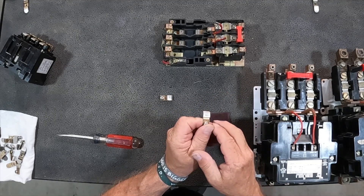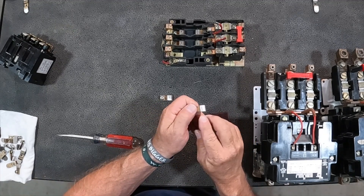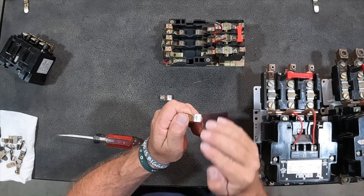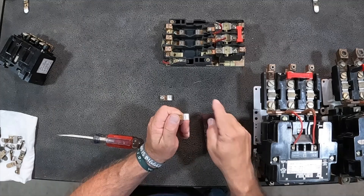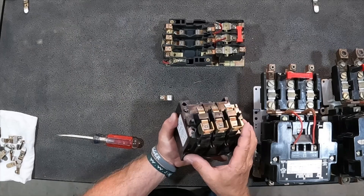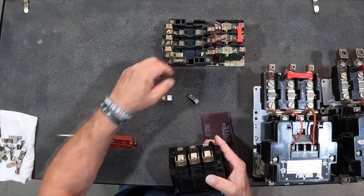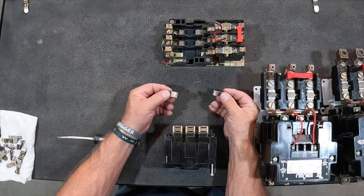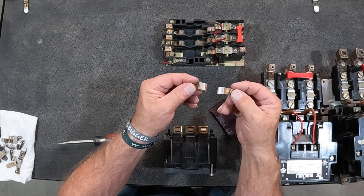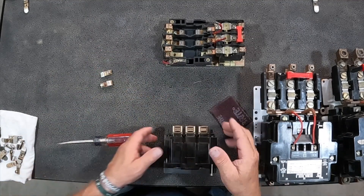You don't want to get too deep into it. If you start with something like a belt sander — which is a little aggressive — you make the silver pad surface uneven. If you make that uneven and you have three of these and the moving contacts come down and press against your other contacts, you're going to have an uneven surface and you're going to begin to get some vibration and noise in there that will also generate heat. Again, heat's a bad thing.